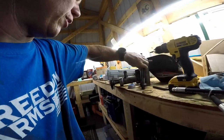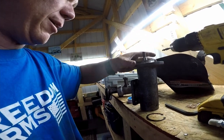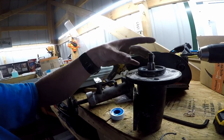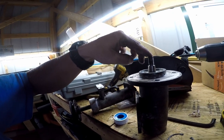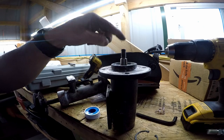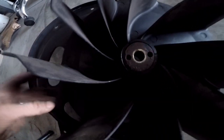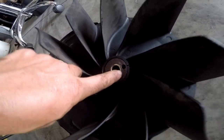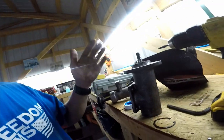The fan drive sets on here — those are your four bolts. All I did was put the nut back on so it wouldn't ruin the threads, and I started tapping down on this shaft so it would start pushing that out, with pressure being pushed up. Hopefully the bolts on yours are not stripped like mine. If these two holes are not stripped, you'll be able to use a pulley puller — we ended up trying a power steering pump pulley puller — but it didn't work in my case since the threads just weren't there.